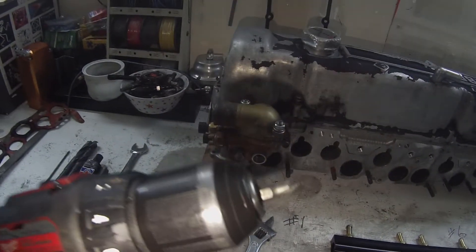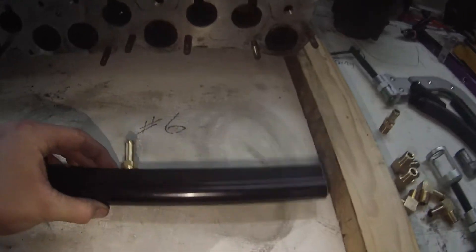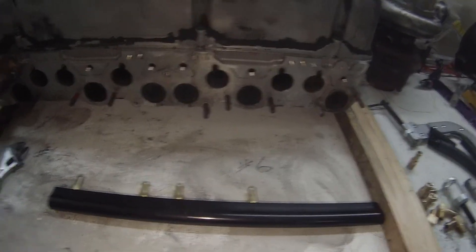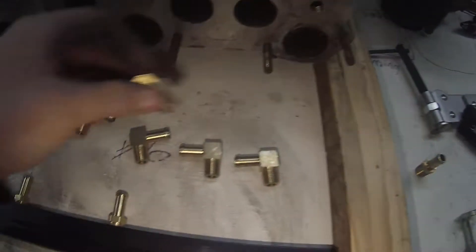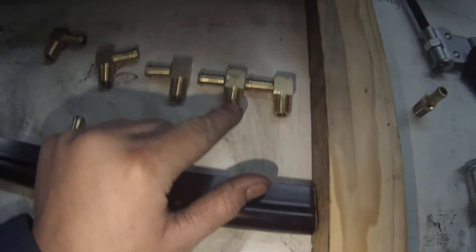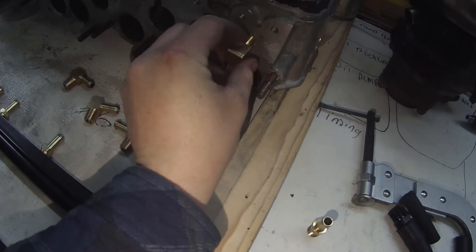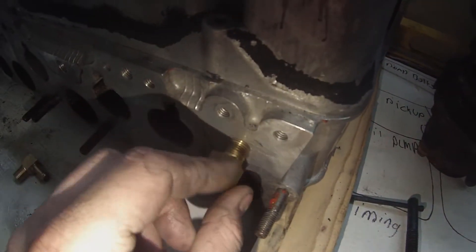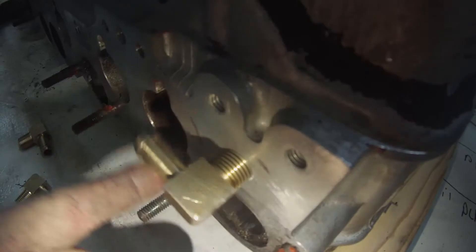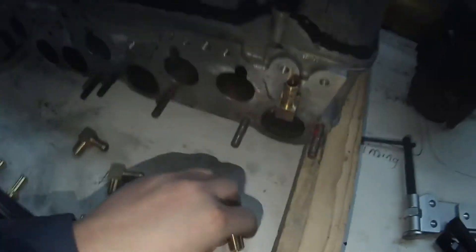Use a punch to mark the center of the hole so that your drill bit doesn't walk on you. If you don't have a punch, you can actually use a Phillips head bit for a drill gun — it's aluminum, it scores really easy. You're going to need five of these elbows. These are quarter-inch NPT thread, 90-degree to three-eighths hose barb. These are going to thread into your head that you just tapped. Make sure when you run the tap in, run it in all the way, or it's just going to thread this far and get stiff. An NPT thread is a tapered thread, so it gets tighter the deeper it goes and seals itself.